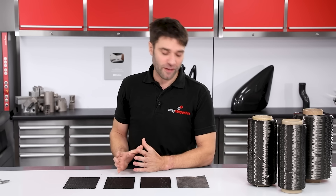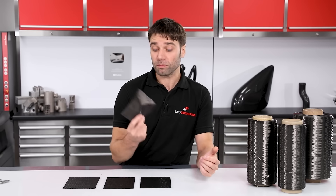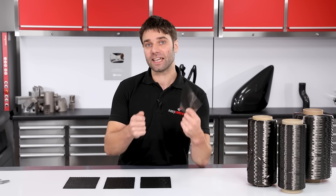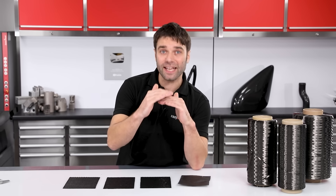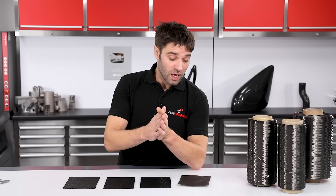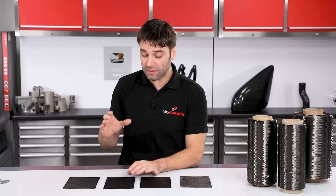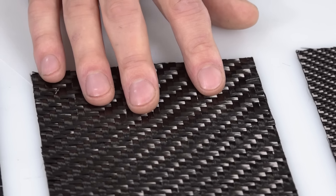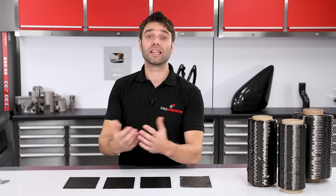When choosing between fabric weights: lighter fabrics are more pliable, easier to get into tight geometries, and multiple plies of a lighter fabric will be slightly stiffer in flex than a single ply of a heavier fabric — the individual plies work against one another in a similar way to a sandwich structure. You'll also get less print-through with lighter fabrics, as the smaller, flatter weave creates less surface ripple. Heavier fabrics are predominantly chosen for cost — they're faster and cheaper to weave, offering more value per given thickness, and there are fewer plies to lay up, saving labour.